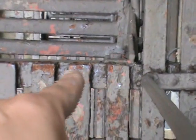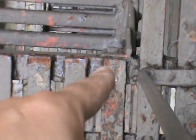You can already see I got problems on the stringer clip holding this whole stringer. This right side needs to be redone. This side over here, even though it doesn't have it, if we're going to load test, it's one thing. Otherwise, 100% change all the bolts. On the treads, we're going to either reinforce the treads with a backup bolt, or we're going to swap out all these bolts, but it looks like these are in good order and they just need to be backed up, but any rust on top needs to be cleansed. So let's walk down slowly.